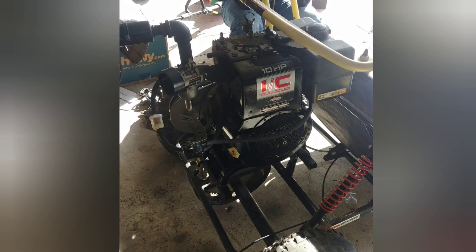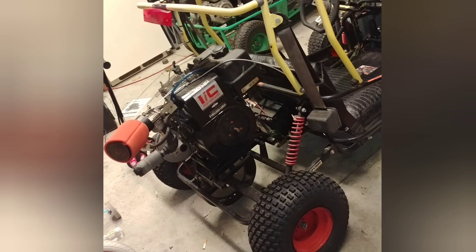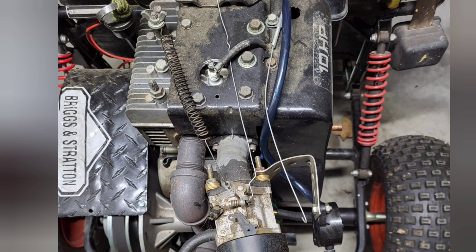Next, I mounted the gas tank to the engine, mounted the engine to the plate, welded the plate to the go-kart, and modified the intake. Here's a top view of my carburetor linkage and return spring. The linkage on the right that's disconnected is for my choke. I always have a fear that my choke cable is going to interfere with my throttle cable and get pinned open, so I only hook that up when I need it.